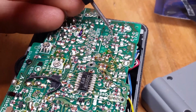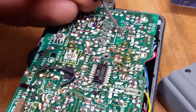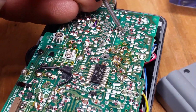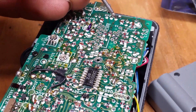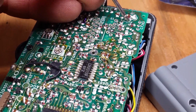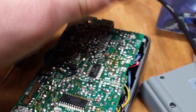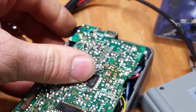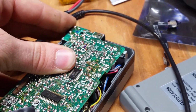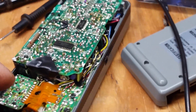Now, I've discovered, thanks to some random guy on Reddit, that pin 18, which is this pin right here on the jungle chip, is the video, so that is where we're going to slam our AV input. And then for audio, after probing around on the board, I realized it was pin 13. And then I realized it was labeled as audio, which I didn't realize. I was just probing around using a function generator. But I figured it out, so that will make it so we can slam audio in right there and be able to adjust it with the original audio adjustment knob and have it internally amplified and all that fun stuff. So that's what we need to do.